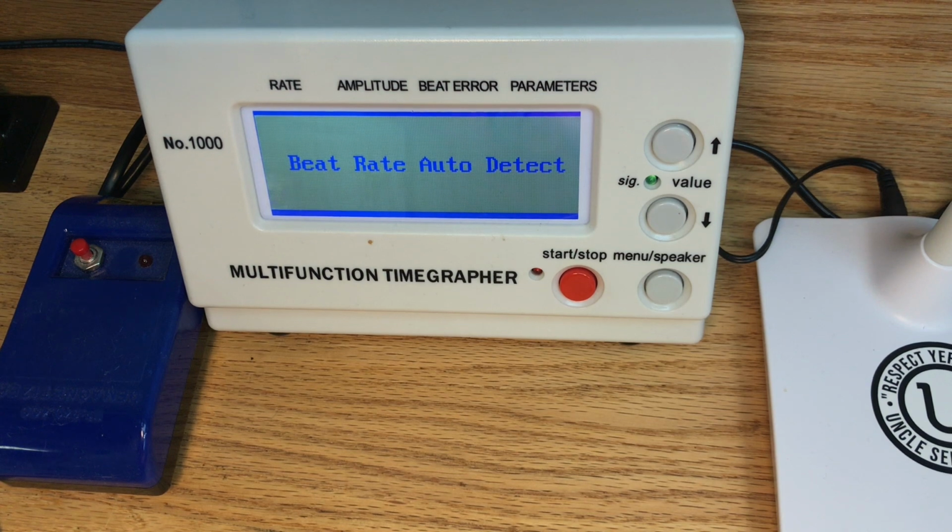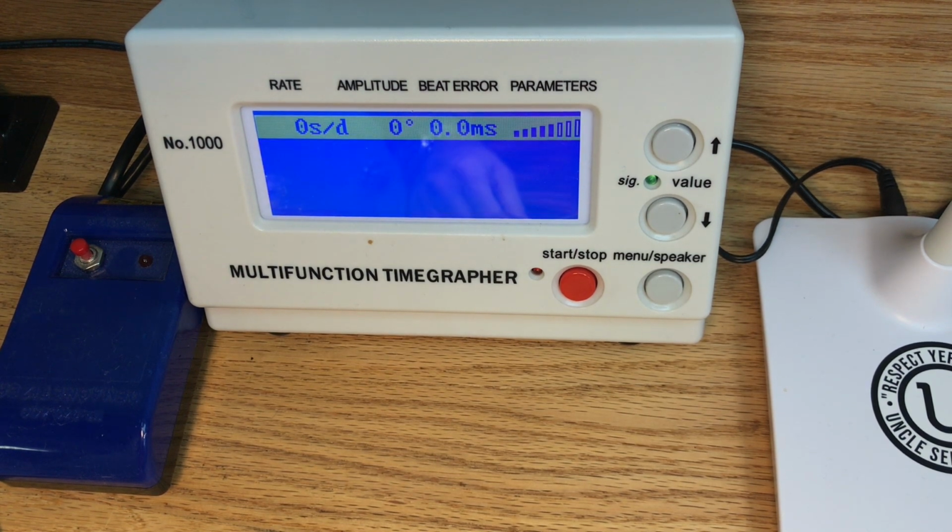So I'm going to change the time actually to more like 3 o'clock rather than closer to 9 o'clock. That makes a big difference. Okay, so certainly you've got something bound in your calendar side on the gear train that's on that side. Still not the cleanest signal, and this may go haywire in a moment. But losing quite a bit of time, you're really out of beat error. Messy signal. So we're definitely going to have to dig in and see what's going on here.